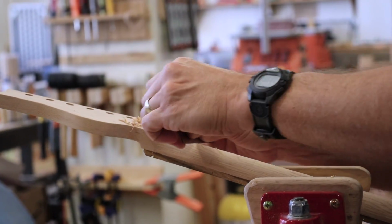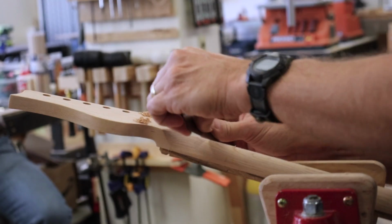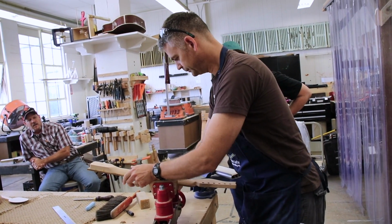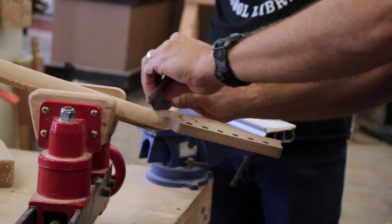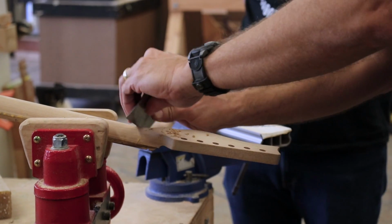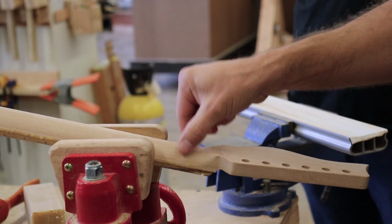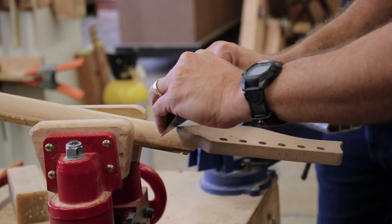You've done a good job sharpening that thing. You're going up on that grain there. Yep. Easy to rip. Right. Try pulling. I probably have pulled before, so this would be more of a... Just take your time and kind of finesse that in, okay? And just work your way towards that line. I wouldn't remove anything from this profile because that's pretty close to where you want it. So kind of just focus on that transition.